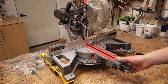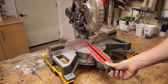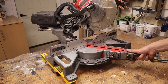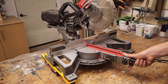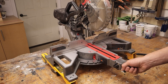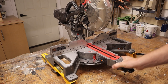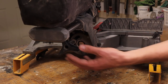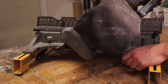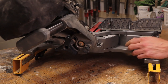To adjust the angle of the blade, you just lift up on this bottom lever and move it to where you want. It has detents for the common degree cuts you'll be using — like your 45 degree, your 30, your 15, and zero. To lock it down, which is very important because there is still play in it, you push that handle down and that locks it and keeps it secure. To adjust the bevel, you spin this loose and it'll move to the left. To get it to go to the right, you pull this pin out and it'll go to the right.